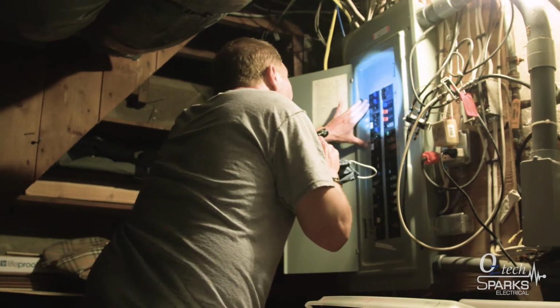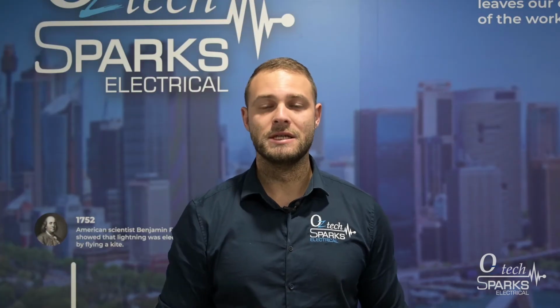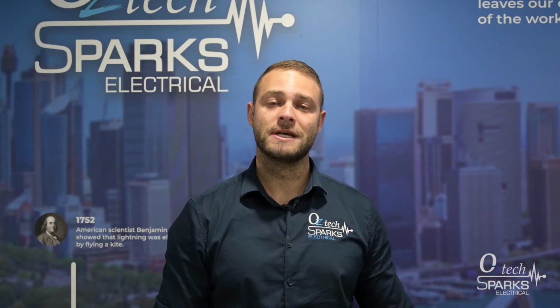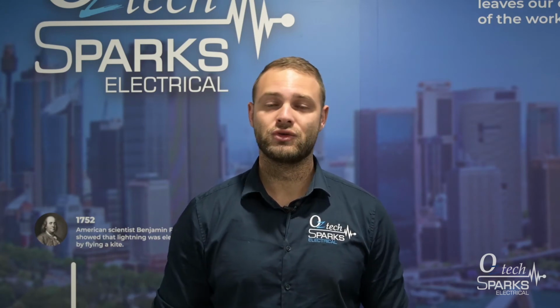Call your local electrician, get the cartridge pulled out, put a new one in. Very simple, very easy, not expensive fix at all. It's going to be a lot more cost effective to install a surge protector in your switchboard than it is to replace any sort of appliance or electronic in your house.